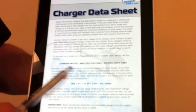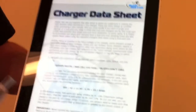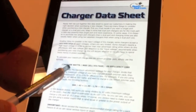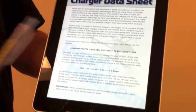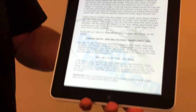We've come up with a very simple formula right here that shows you how to calculate the maximum current that you can put through a battery depending on the charger that you buy. Basically, you take the maximum wattage for a charger and divide that by the maximum voltage of the battery you're trying to charge. That gives you the maximum current you could push on that pack when charging it, minus the efficiency loss for the power supply.